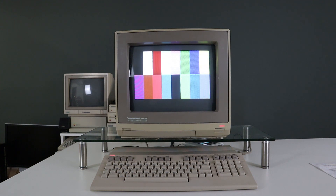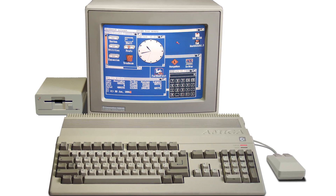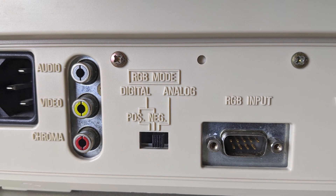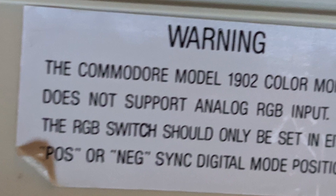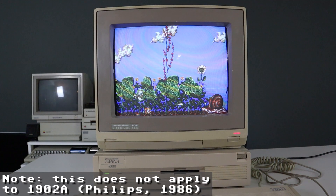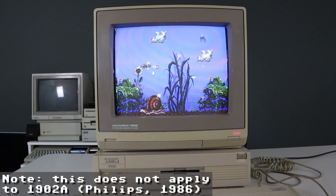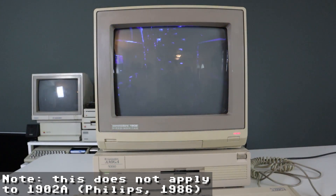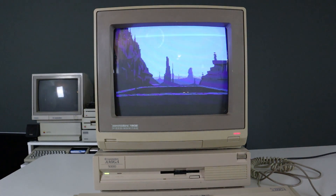The 1902 monitor was intended to be paired with the Commodore 128, so it supported digital but not analog RGB, as did the 2002 and 1084 models that were intended for the Amiga. Although the mode switch has a position for this input and the words are embossed in the plastic case, analog RGB was disabled in the 1902 at the time of manufacture. This was achieved by omission of several discrete components on the mainboard despite all the required circuitry and logic chips being present. It is just a matter of adding back the missing components to turn the 1902 into a fully functional 2002 that can work on an Amiga or any other device that supplies RGB with horizontal and vertical sync signals. While performing the recap I added back the missing components and now the monitor works great with an Amiga. I posted a link to the modification instructions in the description below.